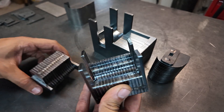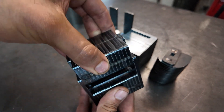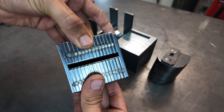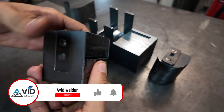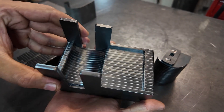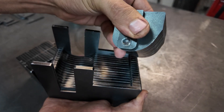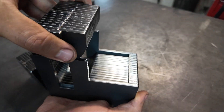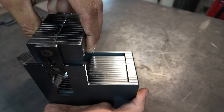To make this bend, I designed a custom punch and die set, so I could form each step of the bend one at a time. This method is both fairly accurate and cost-effective. The bending profile is designed based on the sheet thickness, then cut out with a laser. After that, the number of punch and die plates is determined by the width of the sheet you want to bend. Finally, by assembling them together, the complete mold is built. Then you can place it under the press brake and put it to use.